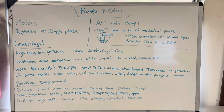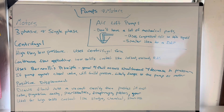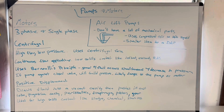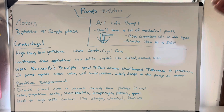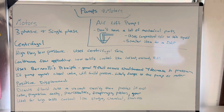Centrifugal pumps — these are high-flow, low-pressure pumps. They use centrifugal force, the force of spinning. If you're trying to move a lot of liquid, these are the ones you want to use. They are designed for continuous-flow applications with low solids content — like influent, effluent, and RAS. Well, isn't RAS high solids content relative to effluent? Of course it is, but relative to sludge? No. A centrifugal pump can move 5,000 mg/L MLSS because what is that still? About 99.5 percent water — it's still mostly water. The most common form of a RAS pump is a centrifugal pump, even though I've worked in plants with airlift pumps as the RAS. That might be asked on your exam.